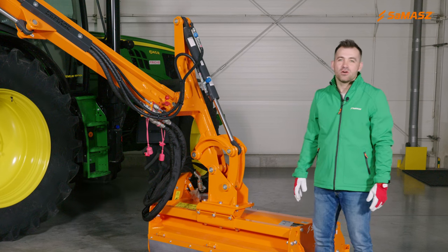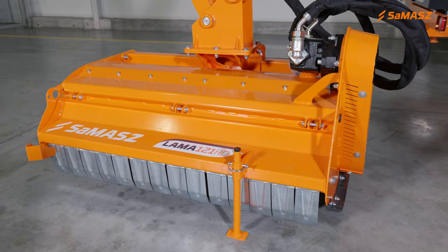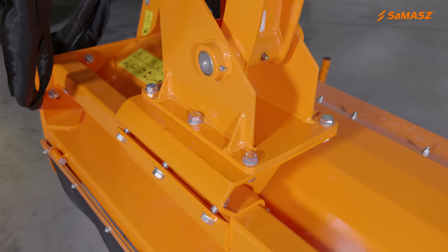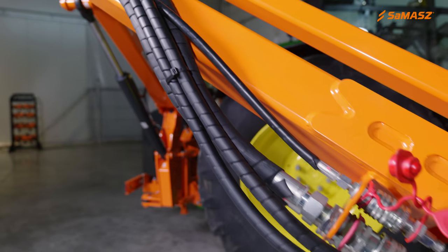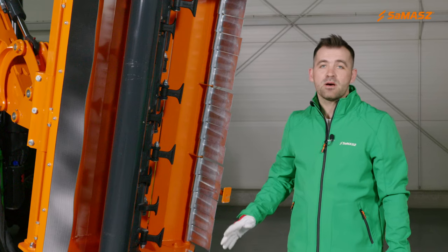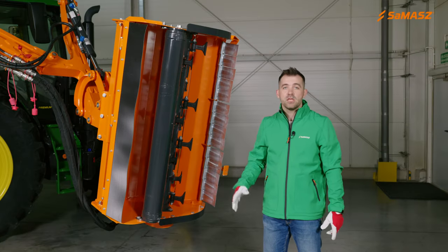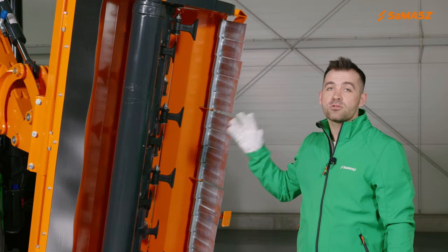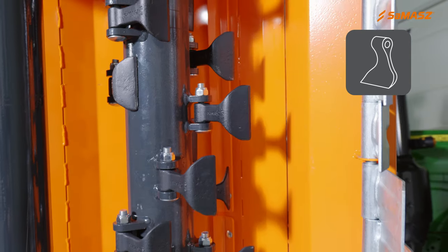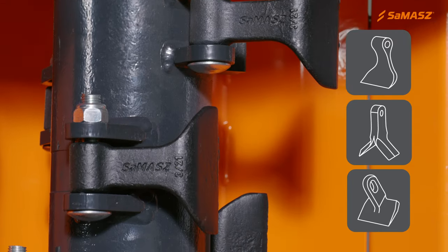Today we have an assembly of KWT extension arm combined with mowing head LAMA-121HD. The header is mounted with a mounting plate and secured with 6 bolts. There are also 3 hydraulic hoses that are plugged in. The HD in the name stands for heavy duty — it means it has a stronger flail shaft than the standard LAMA. You can install various types of flails dedicated for different operations, like cutting grass, bushes, straw, or corn stalks.